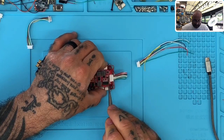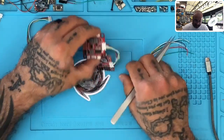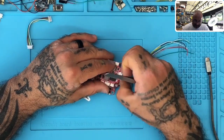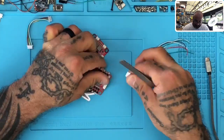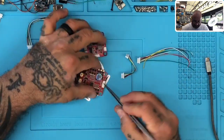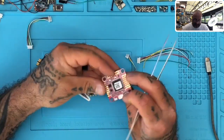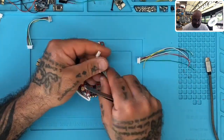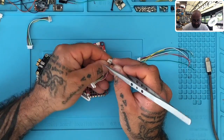One problem. The problem is your UART here is on the end — that is UART seven. However, on the other end here is your current sensor. So even here, with the cable you're using, to match this up properly, this is the TX here and this is the RX here. You would still have to go in and pull the pin — you would pull the pin as opposed to trying to do any resource changing.